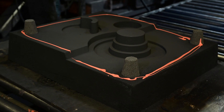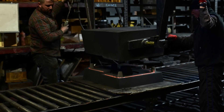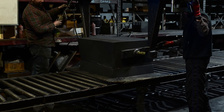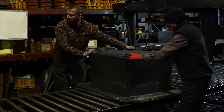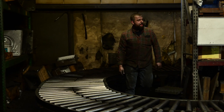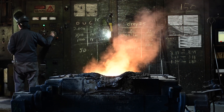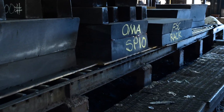These are the two sides — the two parts of the mold — that are being assembled now. They're going to get glued together, and the empty space within these two parts is where the cast iron, the molten iron, is going to go. And that will be, in the end, what our turntable looks like. Every aspect of this process — how diligently and carefully it's done — will have a direct result on the final casting. And even with all this great attention and care, the failure rate is very, very high, because we need something that looks really great, which also accounts for the great expense of the turntable.